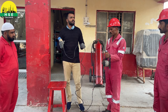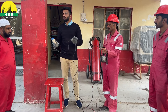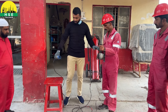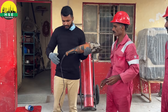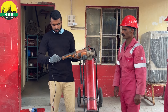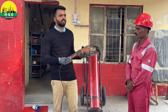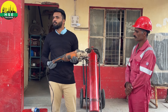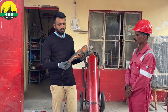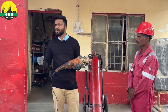We will check the insulation of the wire — the insulation is not damaged, the wire is not damaged. Then you take it to the grinder. Check the connection at the grinder end: the connection must be accurate, not broken. Check that the wire is not damaged. If the wire is damaged or the insulation is damaged here, that is a problem.